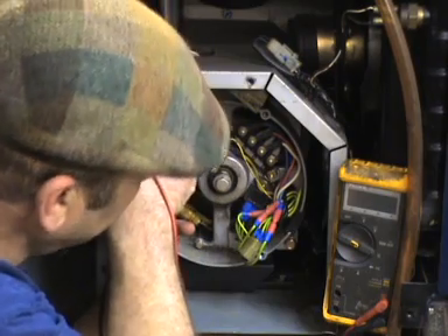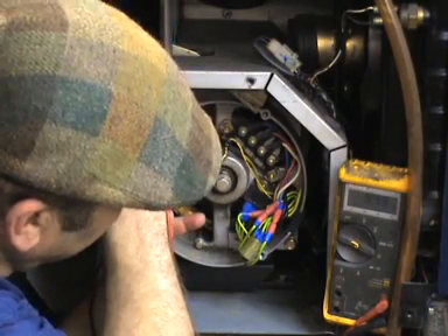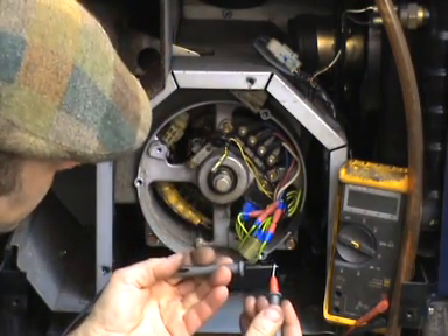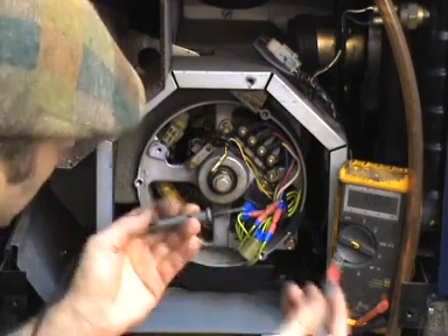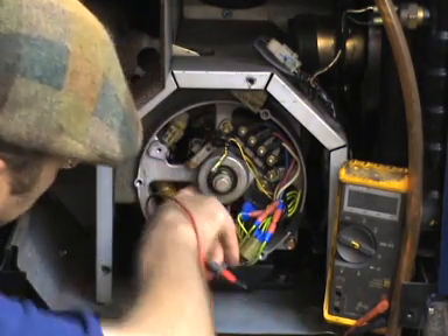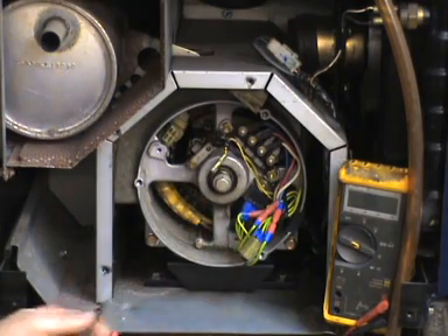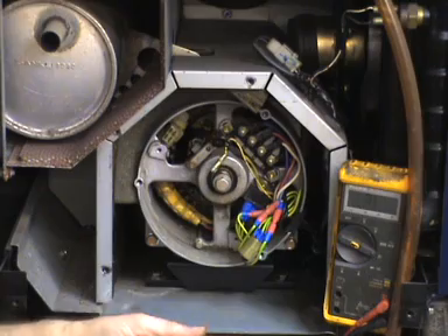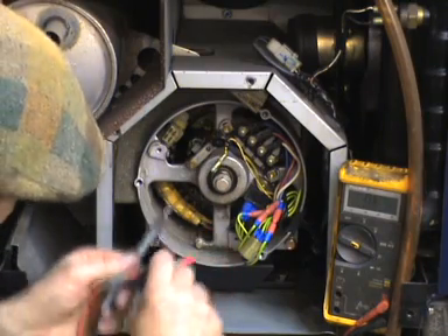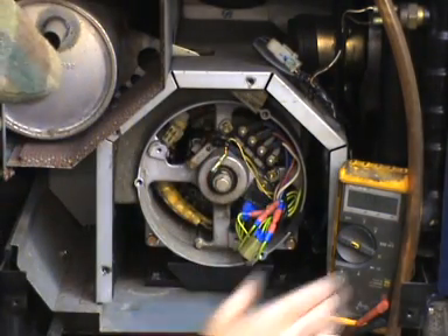We'll just try. I got 84 — there's a little bit of resistance in the wires and obviously there'll be a little bit in the brushes. The only way to really check absolutely properly is to have some probes that have bent over a bit and get straight on the slip rings. But 85 — that's fine. That's telling me there's not a problem there.